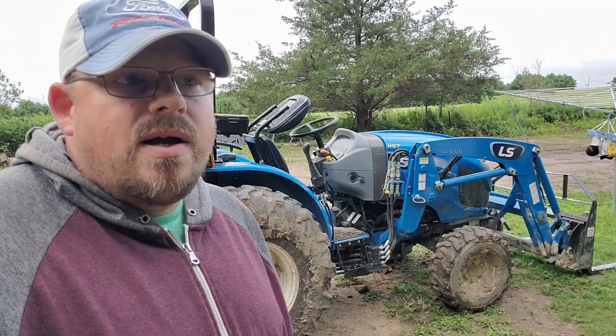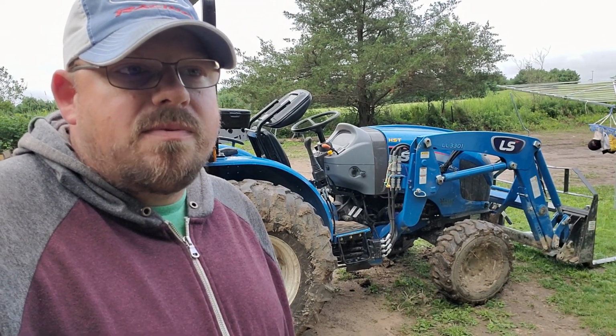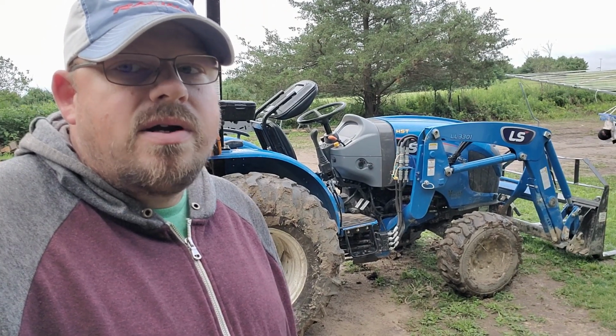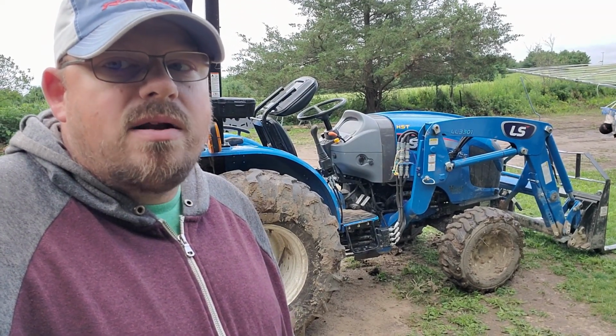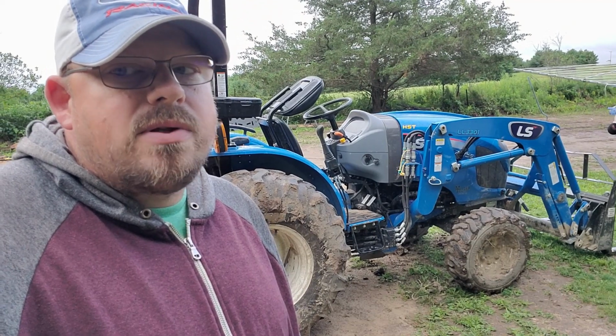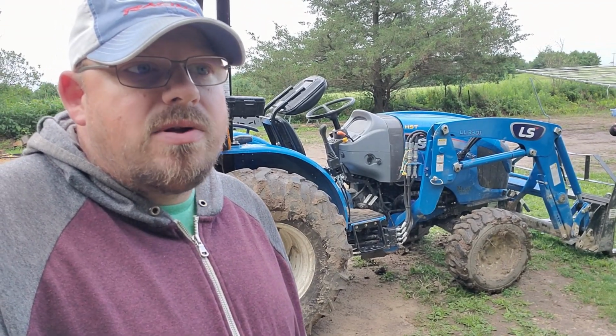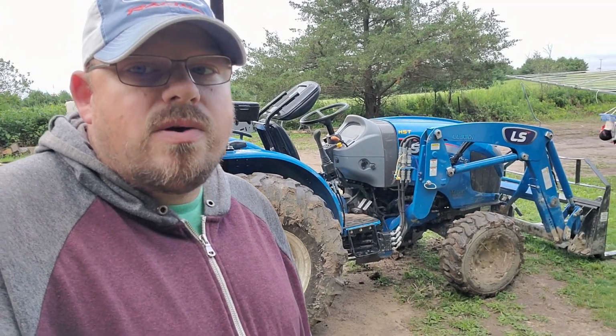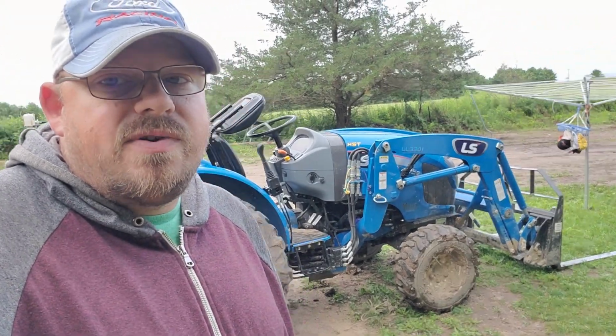Absolutely not. Just the conditions on the property here have taught me that anytime you get into mud with a tractor, if you don't have four-wheel drive, you're not going to be able to do any work. You might be able to drive through the mud, but you're not going to be able to work at all. And what's the point of having a tractor if you can't work? And so you definitely need four-wheel drive on a tractor if you're going to buy a new one.